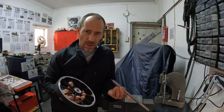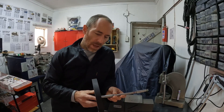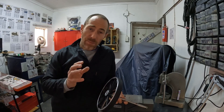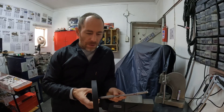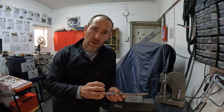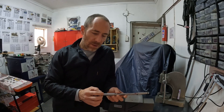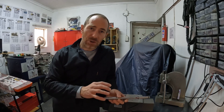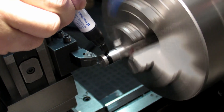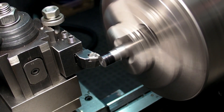The shafts for the Willis engine are relatively easy to turn, but there are a couple of things the construction series tends to leave out that makes life difficult for beginners. The back wheel is a press fit to the secondary shaft. What a lot of people don't tell you is that any press fit shouldn't be perfectly parallel along its full length — because when you start pressing in, the corner digs in and you end up damaging both the shaft and the wheel. Machining the lead-in is very easy.